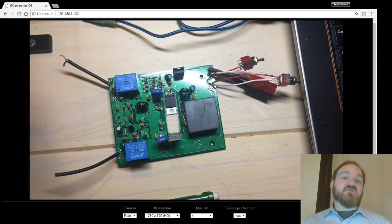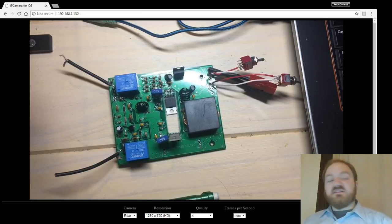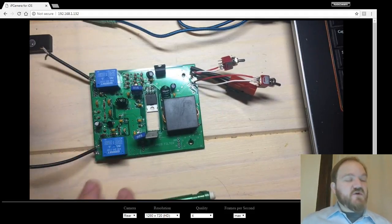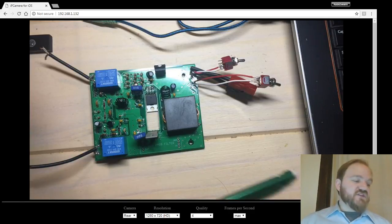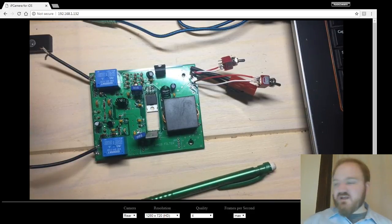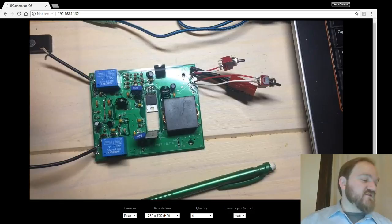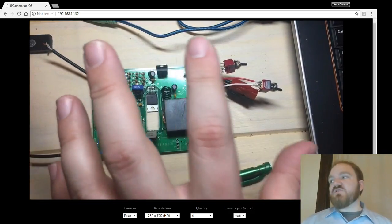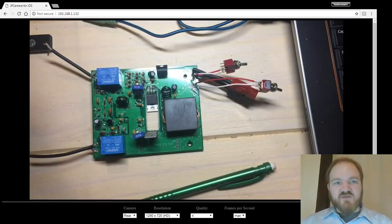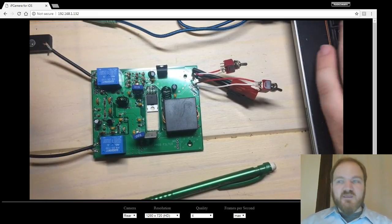Now, his are meant for like 5 or 10 watts, and I'm thinking this is more like a 50-watt output project, so it wouldn't necessarily be that you would use the same filter for both, just that the form factor is the same. Like, if we're going to standardize on this form factor for filters, then if you built a filter for this project, you could also use it for a QRP project, a low-power project, right?